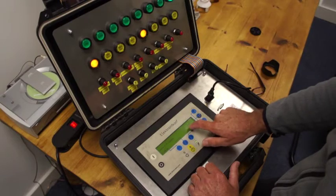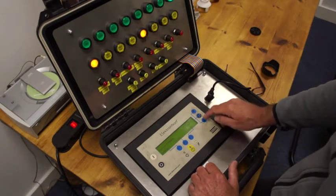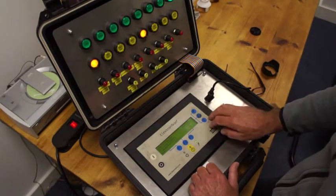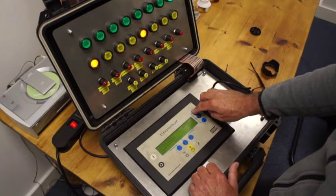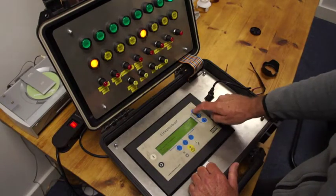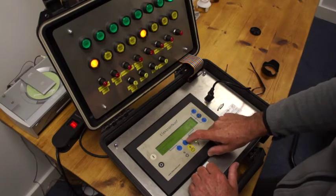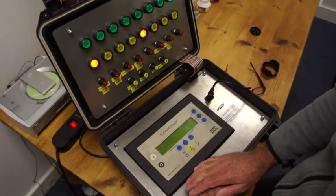Now we can see that the pressure is flashing. We've got program, limits, and cancel. We're going to take it up one notch and down one notch. Press program — it's still the same. Now I'm going to highlight loading pressure. Press modify. I'm going to take that up one notch — it's letting us take it up to 7.3. There will be a limit; if you press limits it will tell you 8.6 bar is the absolute limit. Press return and you've gone back to 7.3. We're going to program that one in. Now we've programmed it — we're at 7.3 bar.